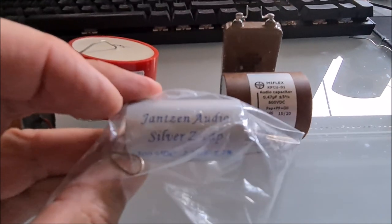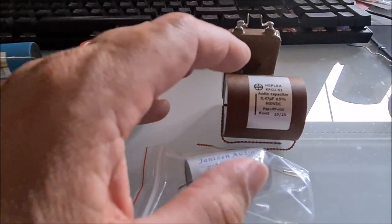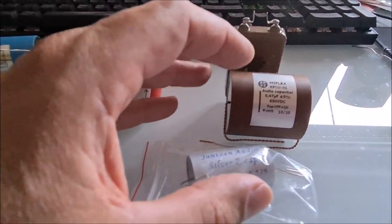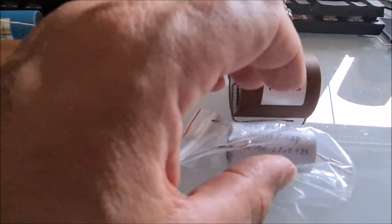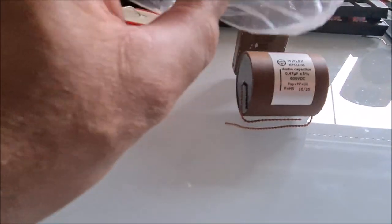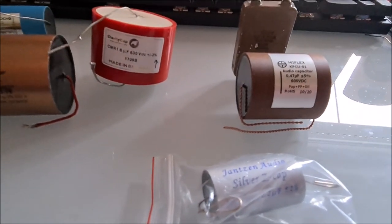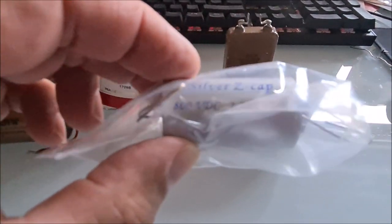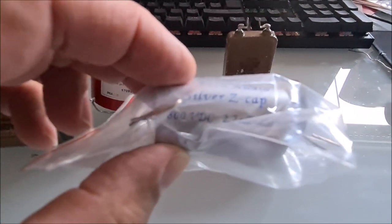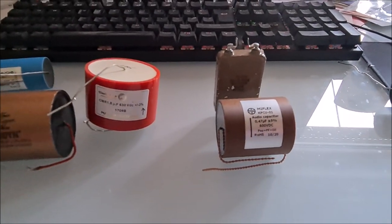If you use this, you will change the complete sound, and sometimes you will have ghosting in the sound. If the value is too big, you have ghosting in the sound. Imaging is double layering or something like this. Don't do this with too much capacitance of the shunt capacitor. Oh, it's really difficult in English.